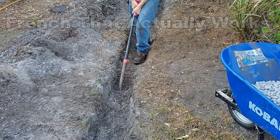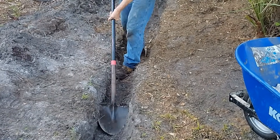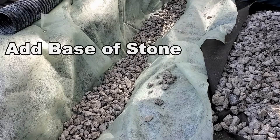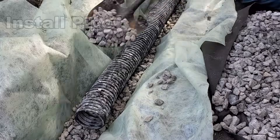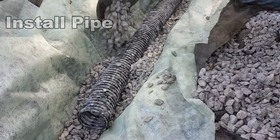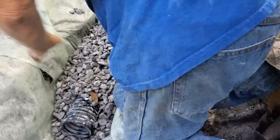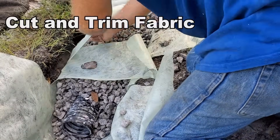We're going to be using four-inch corrugated pipe — it's perforated and slotted, meaning it has holes all the way around the pipe. So you dig that trench and lay out your fabric. We need to add a base of stone — this is very important, this goes under the pipe. Next we'll lay the pipe and then go ahead and cover all of that with more stone, more gravel. Try to use three-quarter inch to inch-and-a-half stone.